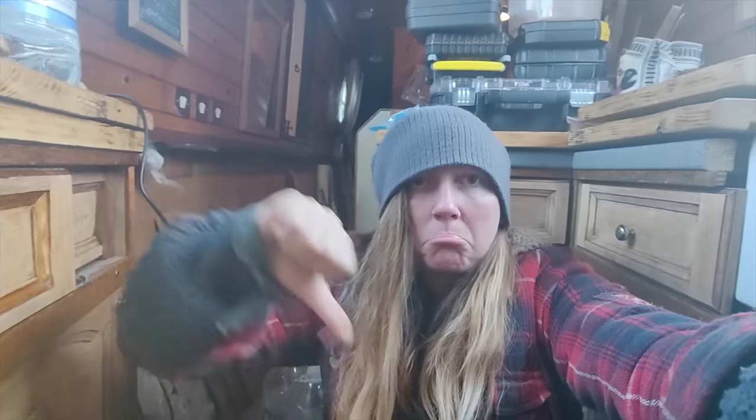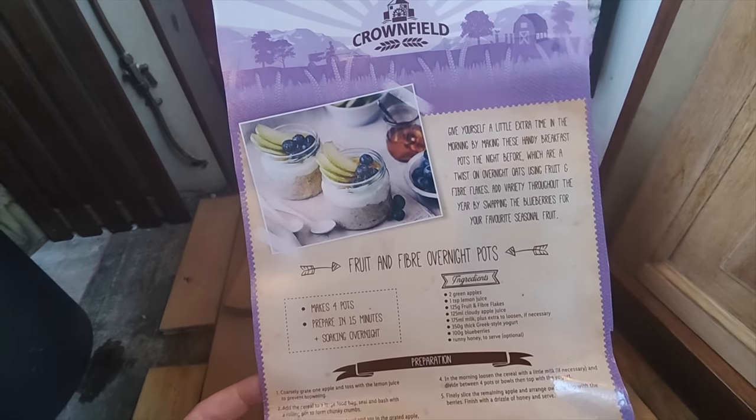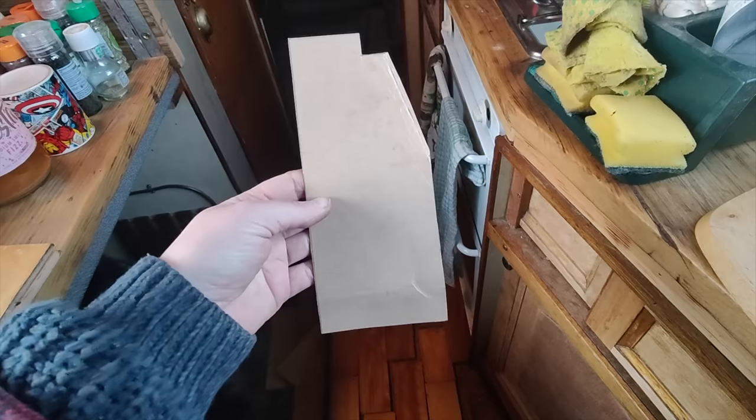As you might be able to just make out, this is my start line. I've got these three panels fitted, and now I've got this awkward little corner to try and sort out. So what I'm going to do is make a template to create the right shape to cut out of my plank. Ordinarily, what would be great is if I had one of those cool little tools where you push it against the edges and it creates an indent for you to transfer onto the piece of wood. But I haven't got one of those, so here's my template creator - it can be made out of any standard cereal box. My little template - I've templated till I can template no more.